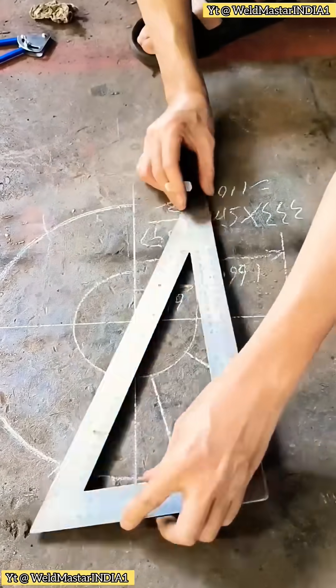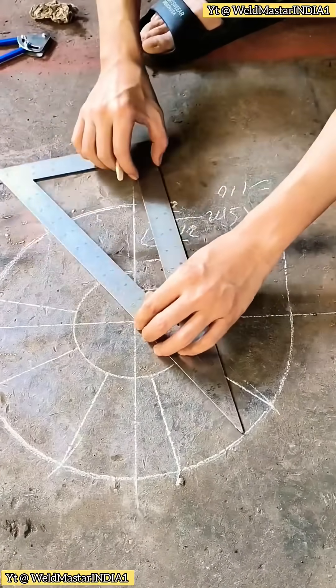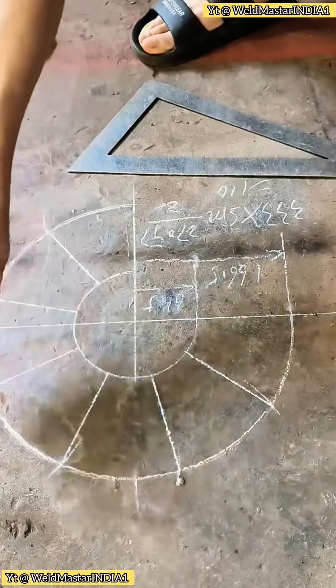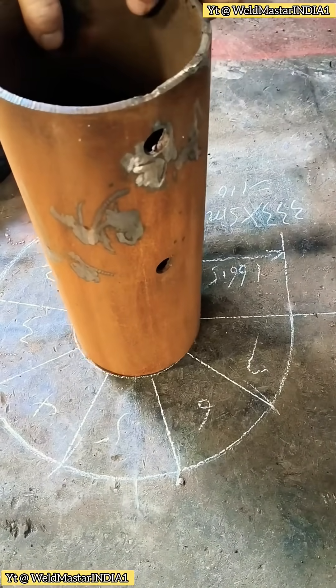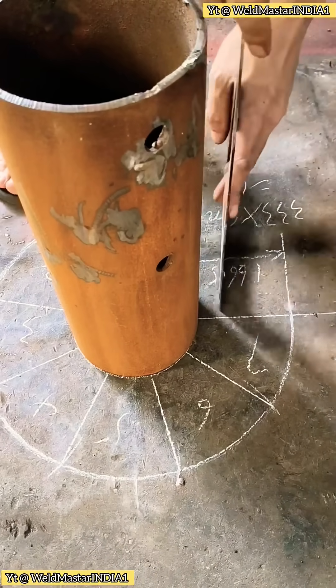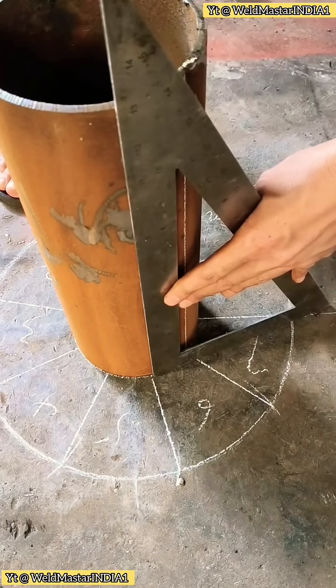Let's take seven steps as an example. Divide the outer arc into seven equal sections and connect each point to the center of the circle. These lines represent each tread plate. When you're skilled, you don't even need to draw the plan — just divide the pipe into seven equal sections according to the arc length that corresponds to the rotation angle.